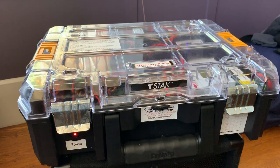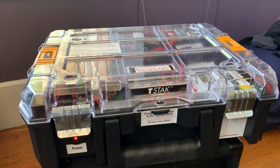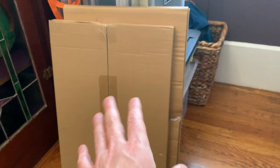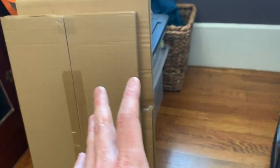What we were looking to do: it had to be battery-powered because the place is totally off the grid. It also had to be solar-powered. Over here I've got two 25-watt 12-volt panels, which I hook up to make a 24-volt system.